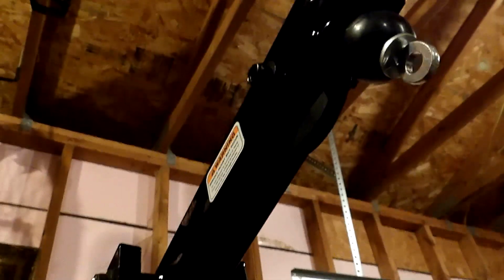On these top ones, it's not going to show up. I wonder if I can see from the other side with the light. Yeah. There is plastic bushings. They are a specific one inside the pack. You can't miss them. They act as the washers for these. I pulled that one out, you can kind of see it. So these top ones do not need them. There's 8 in total, so 1 for each side. There's 2, 4, and then down here, you can't see it because of the lighting there, and then there's more there. They are bushing sized holes. You cannot put them in the wrong spot. They just act as spacers and a place for the pulleys to rub against.